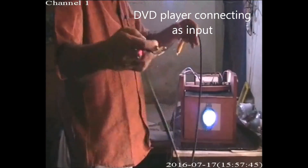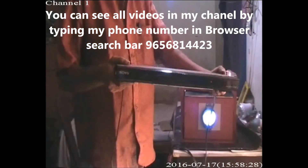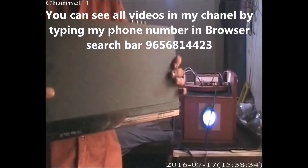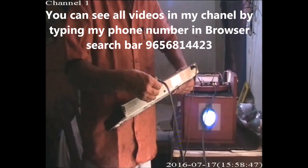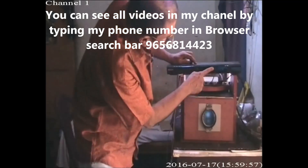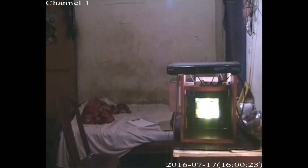This is the audio/video cable to be connected to a DVD player. I am testing with a Sony DVD player — connect the AV cable to the audio/video input socket on the universal board, then connect the audio/video output from the DVD player. Power on the DVD and press play. You can see the DVD display coming on the screen, though the picture appears very bright at this stage.